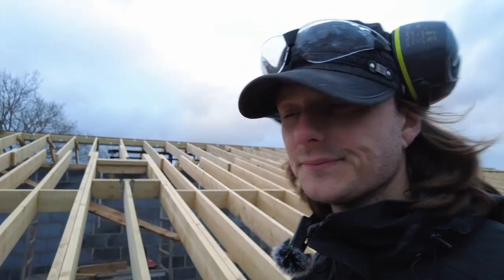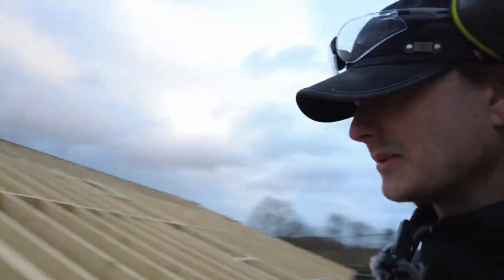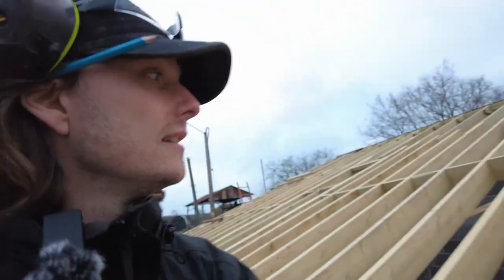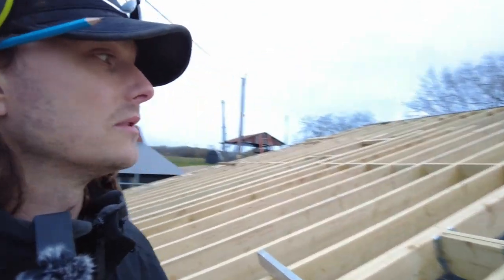Come over this side to do these Veluxes. This one's too small, by at least 5mm. The windows are 780 wide, and that is like 775. So there's like no tolerance whatsoever, minus tolerance. And then this one here is 780 wide, bang on, so no tolerance whatsoever, so that better be bloody square.